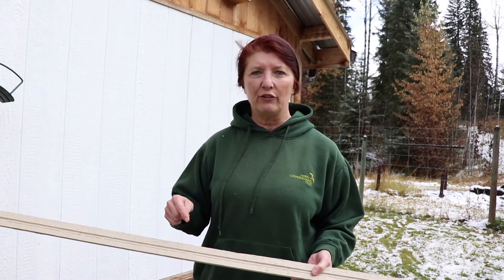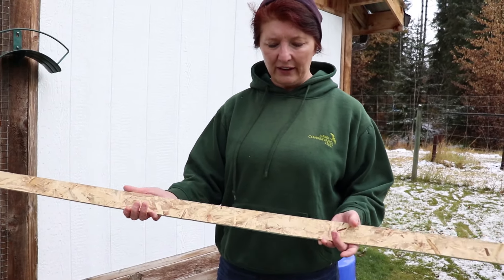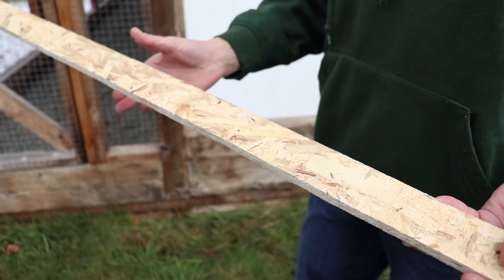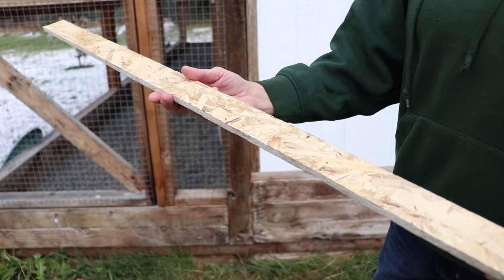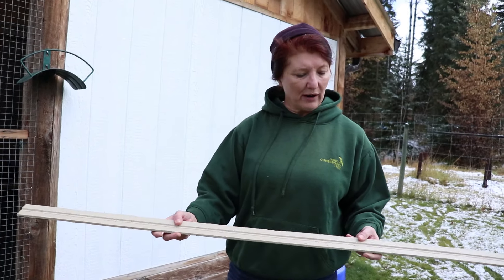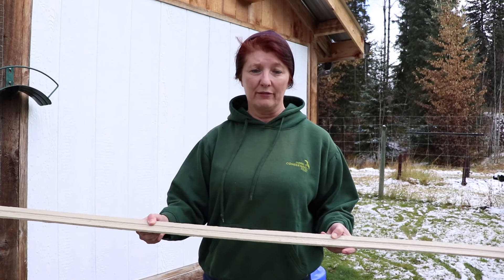This particular product is made right here in British Columbia — in fact, it's made in Dawson Creek. I've got a little piece of it here so we can see what it looks like when it's first made. On the backside, this is made out of chipped up poplar, and then certain resins and other additives are put into the raw mixture and it's pressed at very high heat and pressure into a product that's actually stronger than the poplar it was derived from.